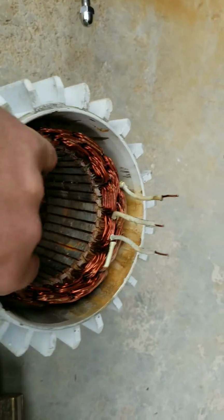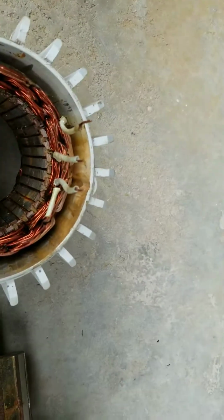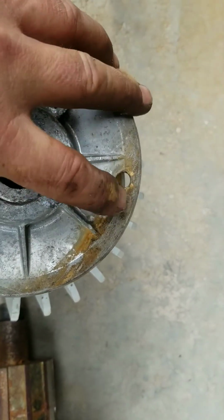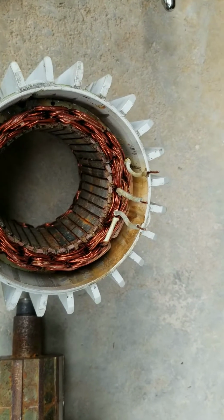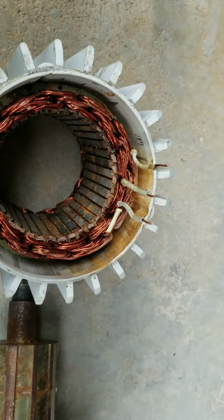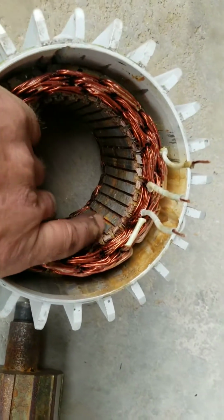The stator winding looks pretty decent. These three wires I had to cut off, but the way it sits in the turbine is that it sits like this, and then your wires come through this hole and are then attached by little automotive type crimps in here, which I don't think really perform an adequate electrical contact. It'd be better if they were soldered, of course. So if I rebuild this turbine, if I decide to, I will solder them. But the stator looks fairly well made.